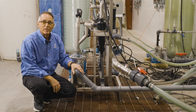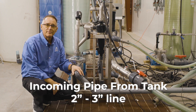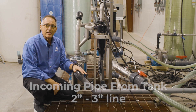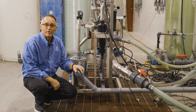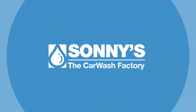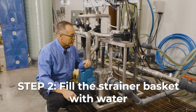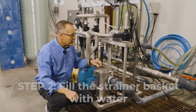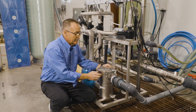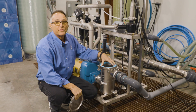The final pipe is the one coming in from the tank — either a two-inch or three-inch depending on the size of the system. It's going to feed water from the tank right back into the strainer basket for us to pull back and re-process. The first part of starting up the system is to fill the basket up with water. The basket is your first point of separation between the tank and the reclaimed system. To start, all you do is remove the lid and fill the basket full of water.